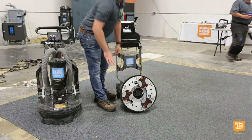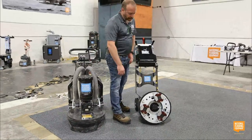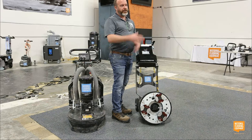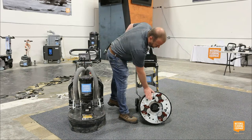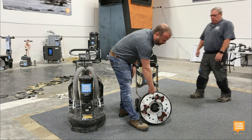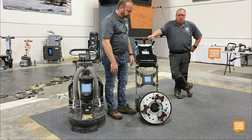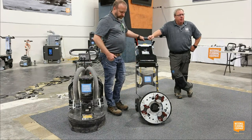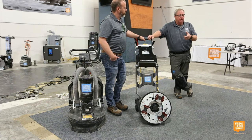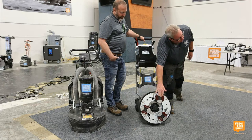Right now, we've got some diamonds on here. They don't really care what direction they move. But let's say you're going to be removing a coating, or you're going to be trying to cut through some adhesive or thin set. You're going to be using some PCDs or some carbides. It's a directional tool. They have to move in a very specific direction. So with a passive planetary, if it follows the path of least resistance, it's not going to happen. With this, there's a cotter pin right back up in here. I can pull that pin, pull these hubs off, and attach my directional tooling directly to this plate. And since the plate spins in one direction, it's going to drive those tools through the material that you're trying to remove. If you're using PCDs, polycrystalline diamonds, which are designed to rip thin sets off the floor, or if you're using one-inch carbides designed to pull glue off the floor or thick coatings, you want those tools because they're specific direction tools. You want them mounted to the plate. They wouldn't work very well here.